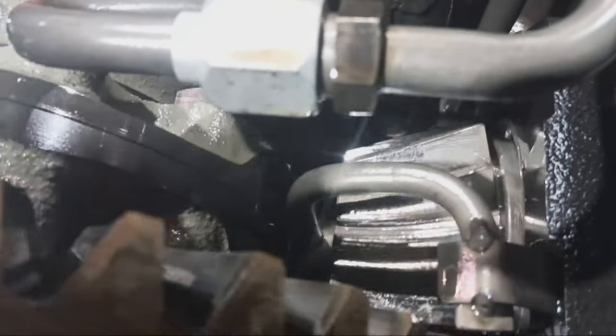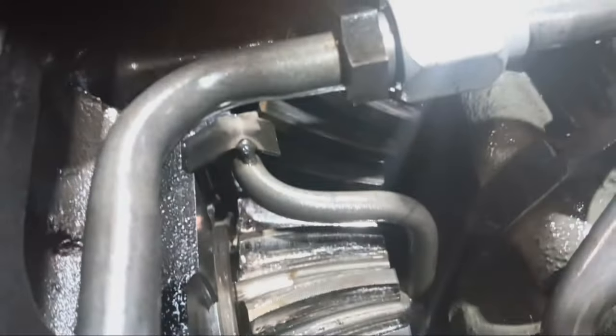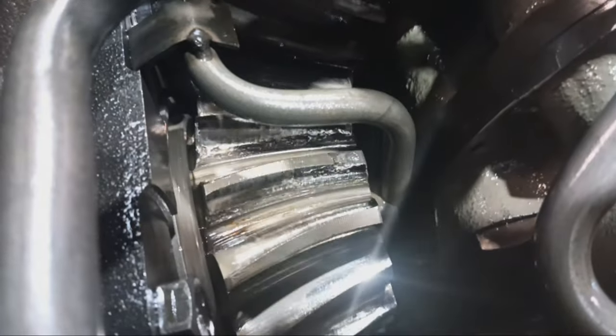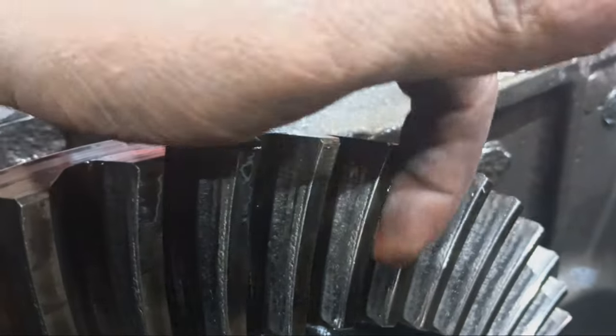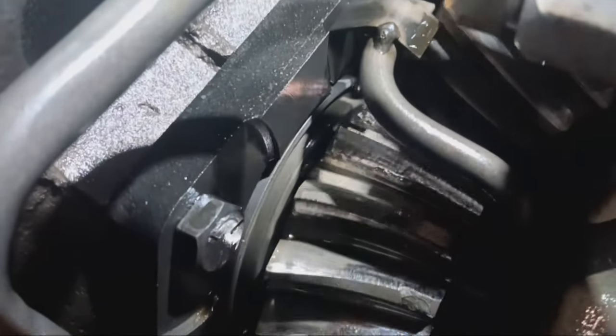That's the pinion. It does not look very good. Let me get it to a gear that is the ugliest. There's a couple chips taken out. Let me jump to the other side. So there is a chip. The pinion is chipped. The ring gear has definitely seen far better days. The hard face is worn through, but the pinion bearing is the main issue. She's very loose in there. So let the dissection continue.